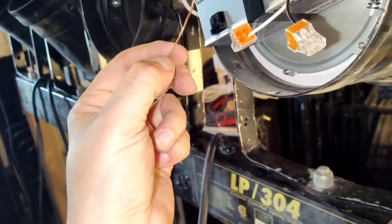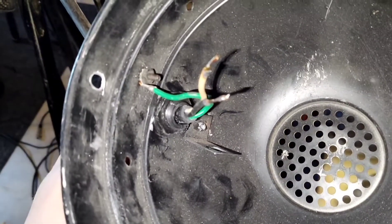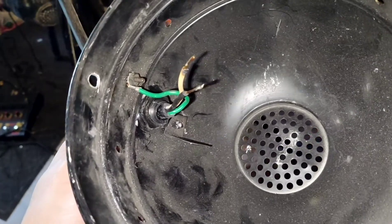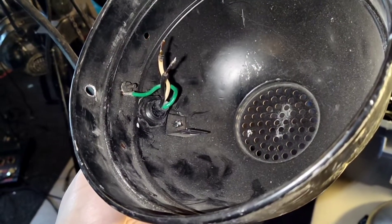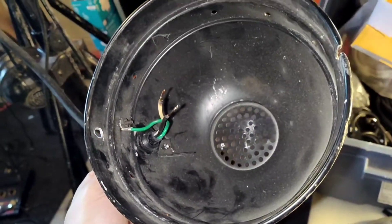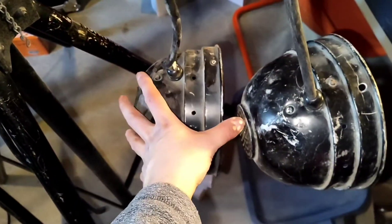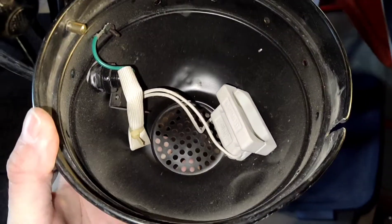I'll basically cut this guy right off and just use the ground strap to the grounding location on the PAR can itself. I try to use as many of the factory locations as possible - they're there for safety features for a reason. I probably won't sell this thing, but there may come a time where these get passed on, and I want to make sure these things are as safe as possible. If you look at the one next to it, this one still has a connector inside - I wanted to do a side-by-side to show you the process.